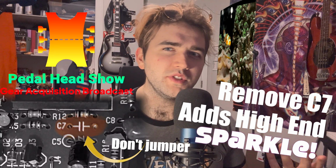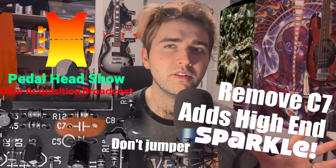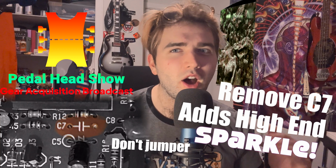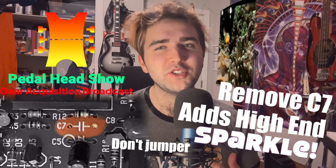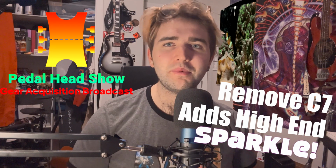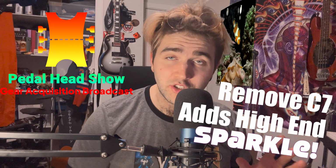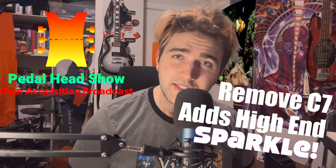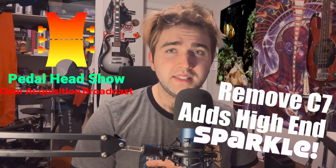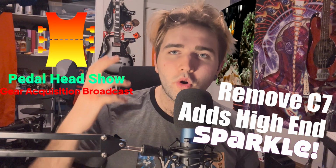If you just remove C7 and not touch R9, you might think that might be enough for you to keep the pedal more stock, but yet still get what you want with your distortions, especially if you have the TR-2 in front of your amp, not in the effects loop. Anyways, I've removed it. We're going to hear this in conjunction with the R9 mod. So let's hear this sound example of the C7 mod with the C7 completely removed to add more brightness and fidelity to your output signal.